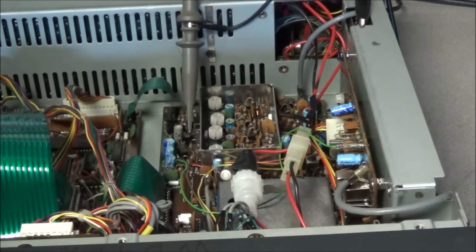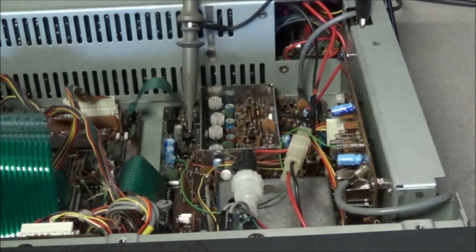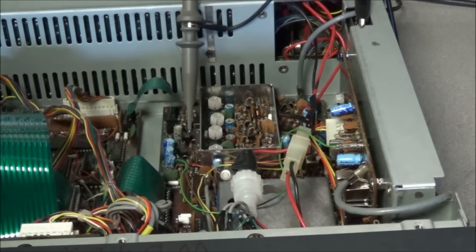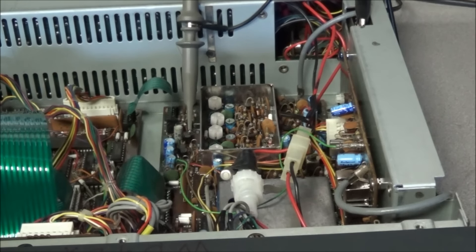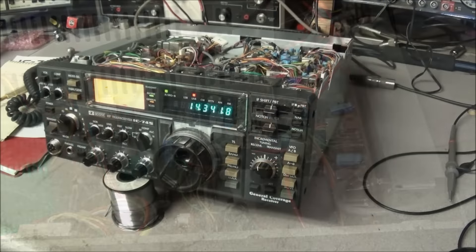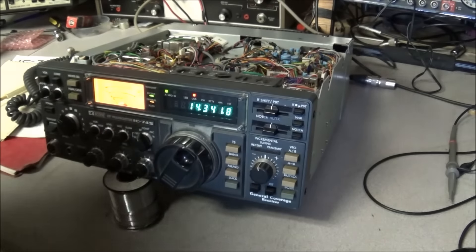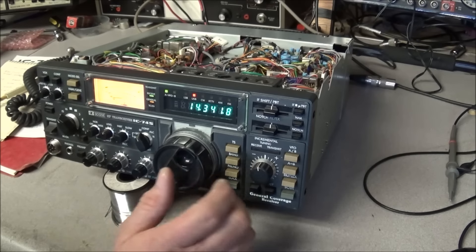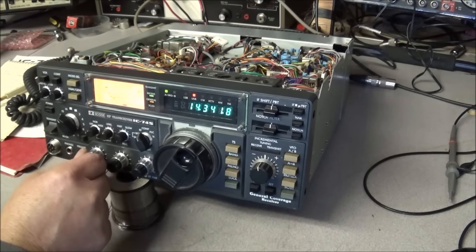As I said, I think R43 is okay. We seem to be able to get a good voltage swing on each capacitor as we tuned them, and I don't think we'll need to worry about changing or lowering the value of R43. We'll leave it at the stock value and see how that goes. Since we've spun all the capacitors around and hopefully got a lot of the contamination out of them, we'll do a little on-air test and see what we get.